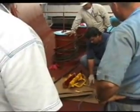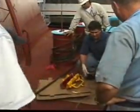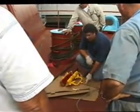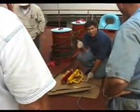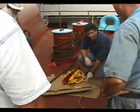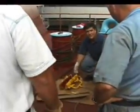But this really, in case you're wondering, isn't a discharge tube. You're not going to have grease coming out of it. The grease is going to come out that far, then I shut the pump off. Then we start the travel, and I open the pump back up. And it won't be coming back out of here anymore after that. It'll follow the rope. Grease always follows the easiest path.